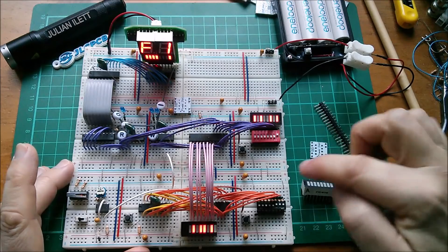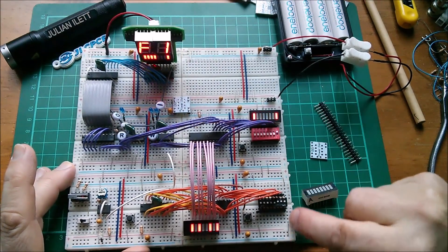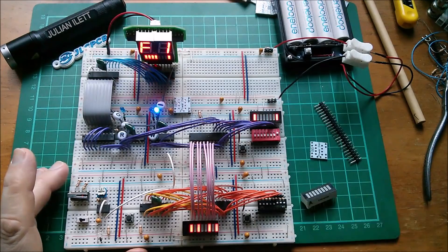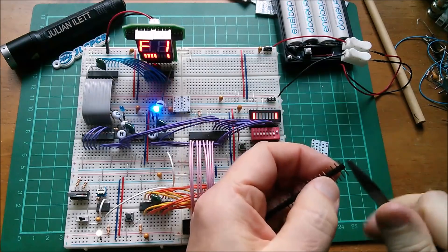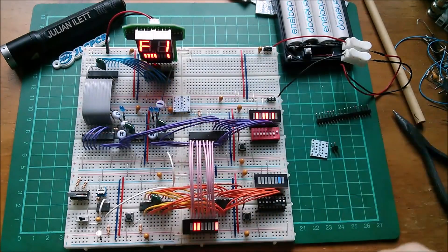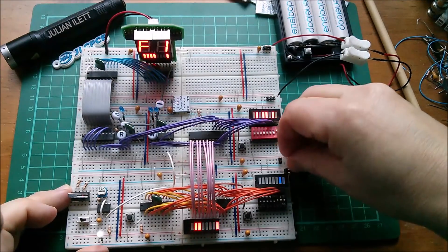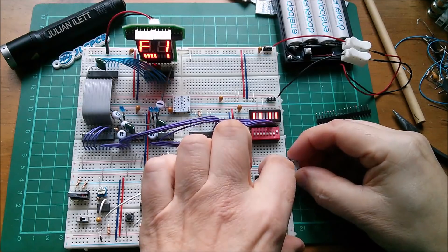I just want to make a new link — it has to sit in this end hole because it runs down across here; it's a grounding link down to the bottom. I just want to angle it in that way a little bit. Right, that's done. Let's break off another couple of pairs and put them in the board where they're going to go — there and here — and then my board is going to straddle that.